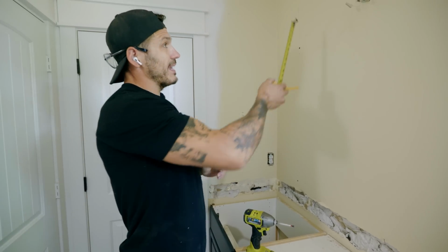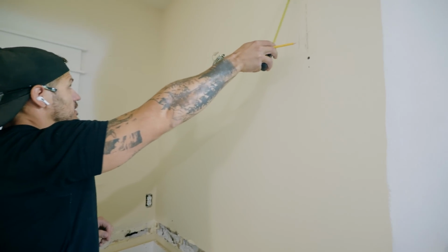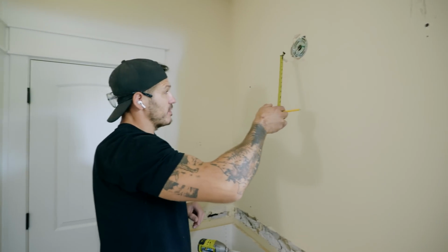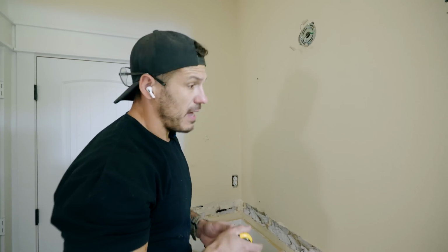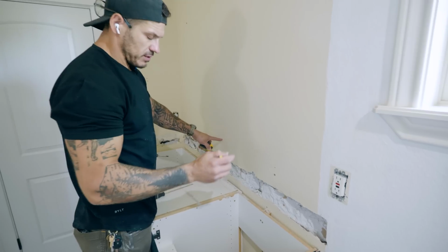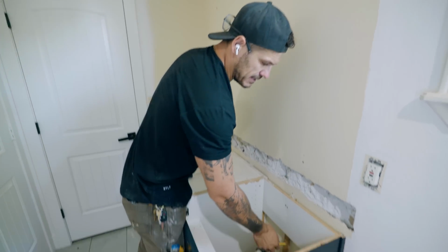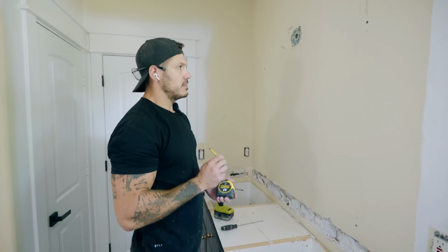So, we're gonna need to get rid of this electrical box. We need to run 2 circular boxes there, run the power from this or from there, whatever it comes from. And then on top of that, we need to move this outlet to be here, so it's actually more functional, and then tether an outlet in here for the LEDs. That's our plan so far.